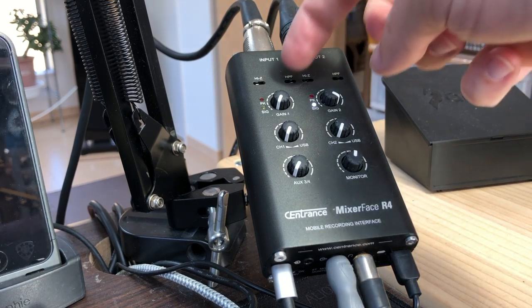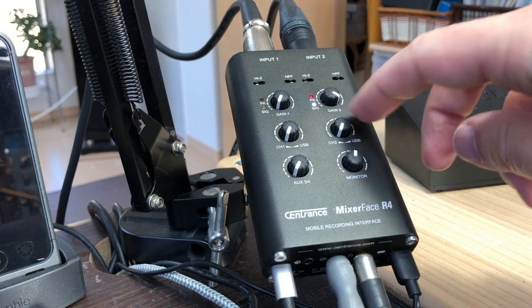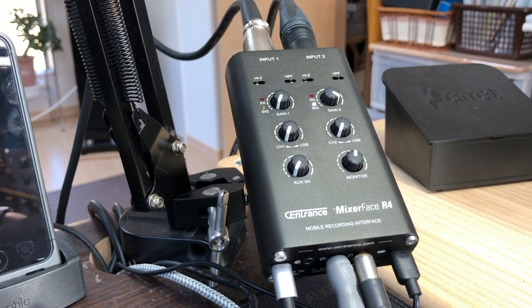There's a high pass filter as well. These particular mics pick up low frequencies pretty well, so they pick up machine hum from computer stuff running around me, and I have the filter switched in. The useful thing is you can balance the channel versus USB because it's a two-way USB. I tend to use this most often for Skype - I can make a very clear Skype call, or maybe do a podcast with somebody over Skype, and having good clarity really helps.